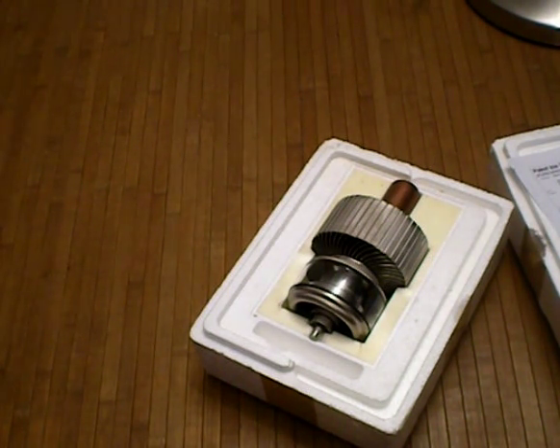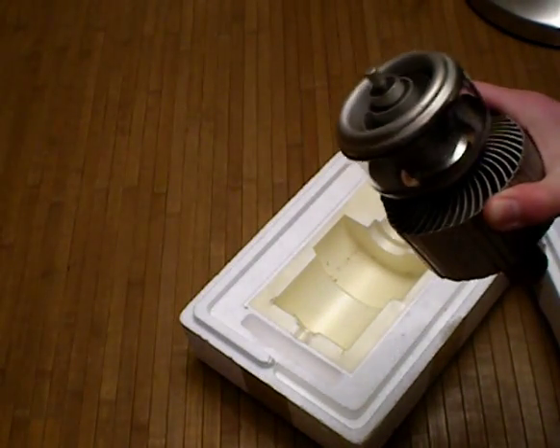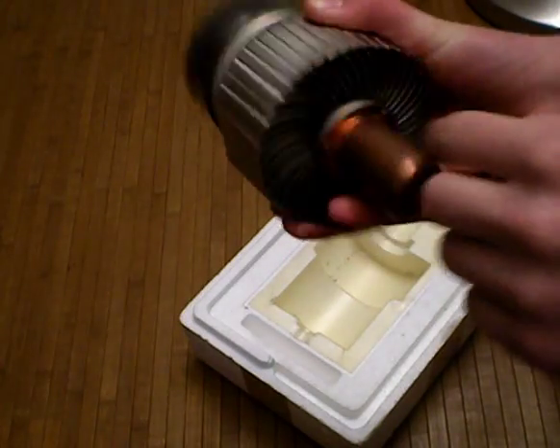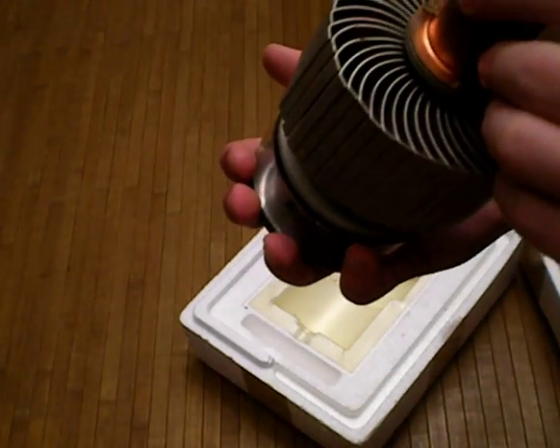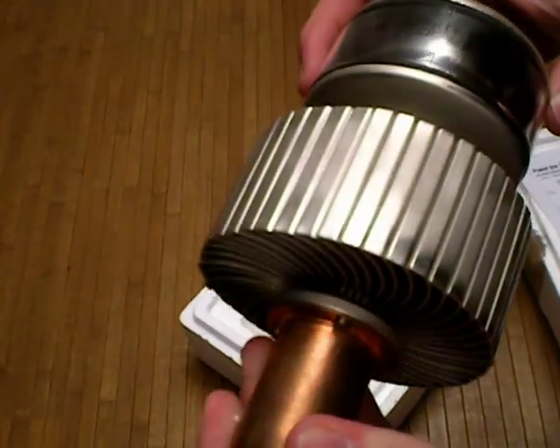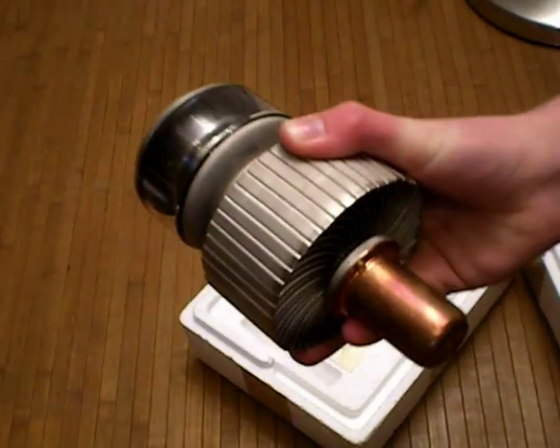You probably can't hear me that well because I'm a little away from the camera right now. I guess the continuity on the tube is good, the filament is good, and it's new — except for some dings on the heat sink. And remember how these were mounted — how the heat sink was cooled. I think it was cooled from this direction or from this direction. What I do know is they are mounted like this. One thing that you don't see very often on these GU-type tubes is that there's no paint — there actually is no paint on the shroud down here.